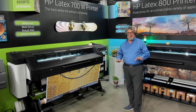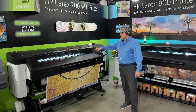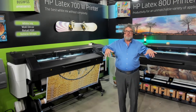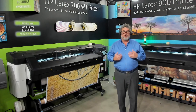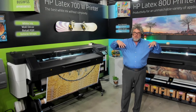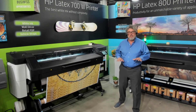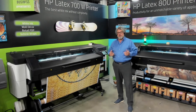This material needs that tension even, straight, and continuous on the front of it, or it will not travel through the pinch rollers very well. When you choose fabric on a 700 and 800 series printer, the pressure from the pinch rollers is not as severe as if you chose paper or adhesive vinyl, where the pinch rollers and drive roller make a stronger point of contact with more downforce. With fabric, we left that a little lighter because you don't want to push down so hard on soft textile that it tunnels from the pressure and travels into the print path.